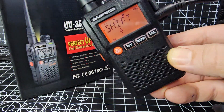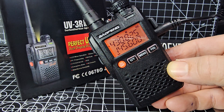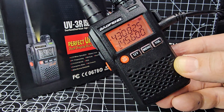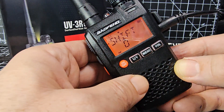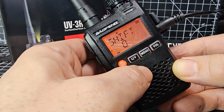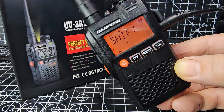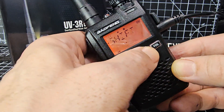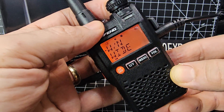For shift — plus or minus — when you key up for a repeater you transmit on one frequency called the input and listen on the output, which is the frequency we can see now: 430.825. Go to menu, press UV, and turn — you want a plus shift for 70 centimeter or 433 MHz type frequencies. Press UV back into menu.